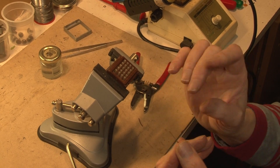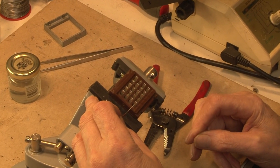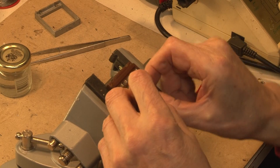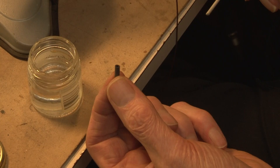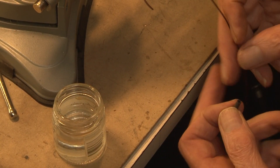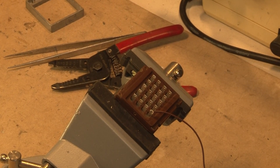I've cut it quite long, far longer than is needed, but what is required is that it's threaded through the hole in the tag — it's like trying to thread a needle. That's gone through nicely and that then is wrapped round, round the back and into that little notch, so the wire is now mechanically secured. Now I take a small dab of Hellermann oil on the cotton bud, put it in the sleeve like that, and that will enable the wire to slip through very nicely. I'll run that up to the end and just leave it hanging there until I've got the soldering done.